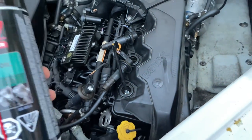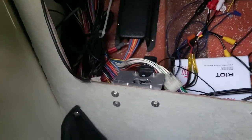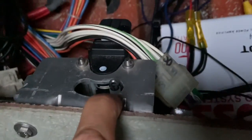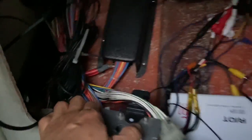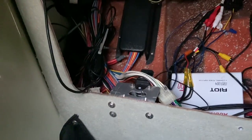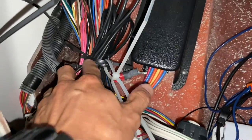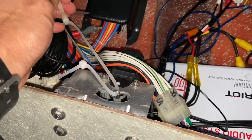I'm going to fog each one of these cylinders. But before we do that, we need to run the engine. We have to tie the throttle — this little lever here gets tied back. What happens is it goes into a kind of limp mode, so it doesn't run fuel into the cylinders. I'll use a zip tie to hold it all the way over. It cuts the fuel.